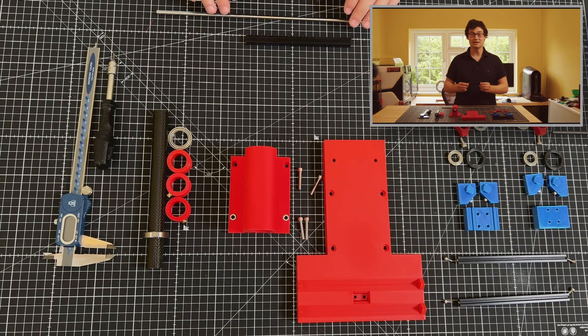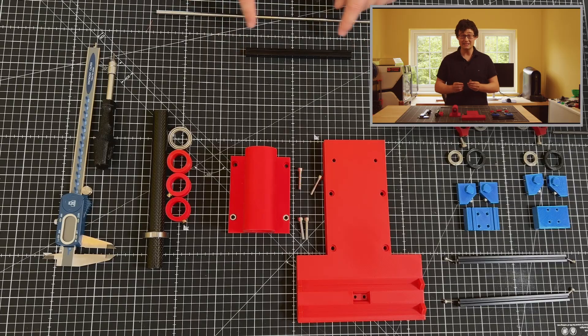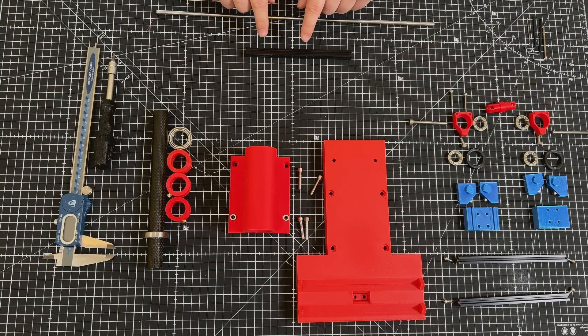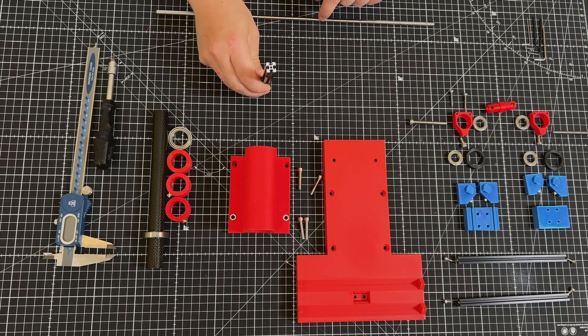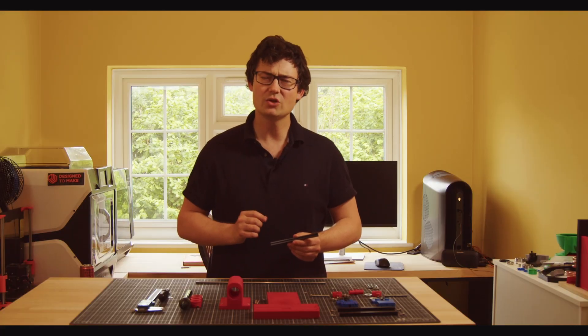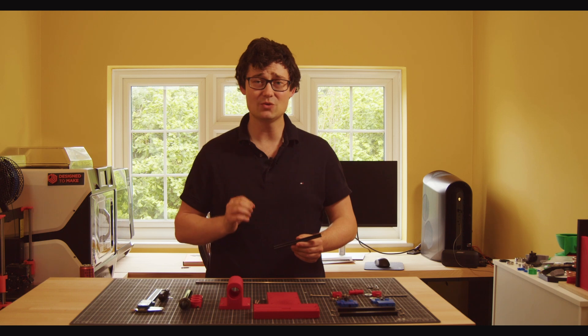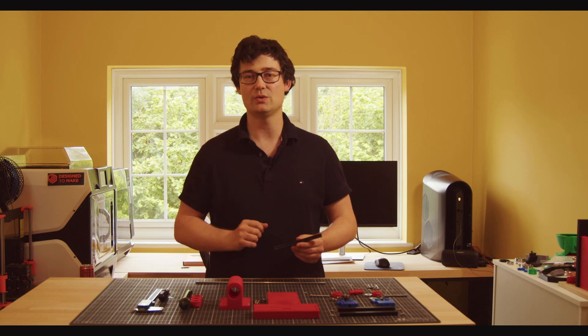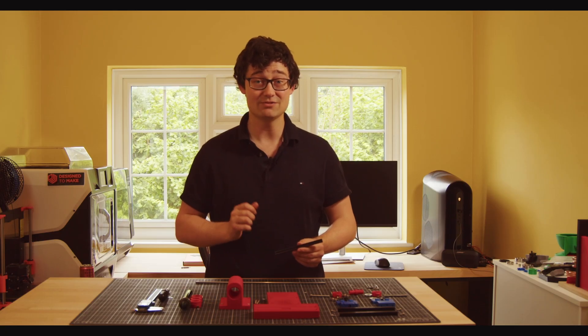Here I've used a maker beam — a 10mm maker beam I had. You could use a linear bearing shaft, but I'm hoping this is going to be a bit more rigid to lateral motion. I also wanted to see how well the T-slots would work to constrain the motion to one dimension without sticking. It's basically a scaled-down version of a 2020 OpenBuilds aluminum extrusion — I guess you could call it 10-10. It's really great for building small lightweight frames and assemblies quickly, and I'll pop a link to it in the description.